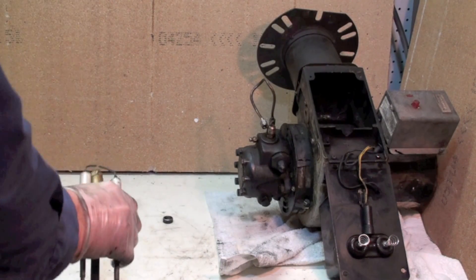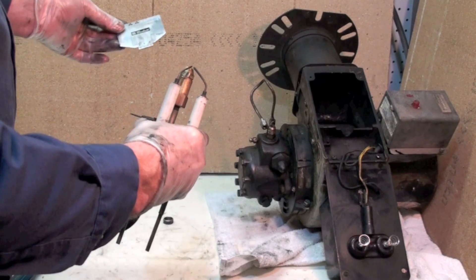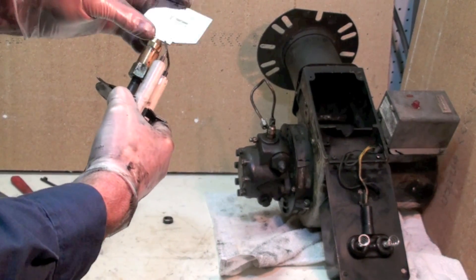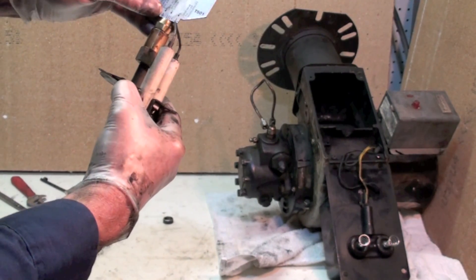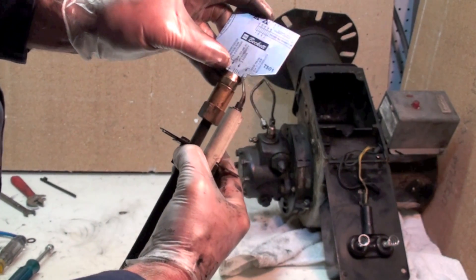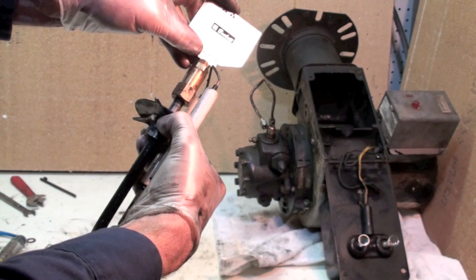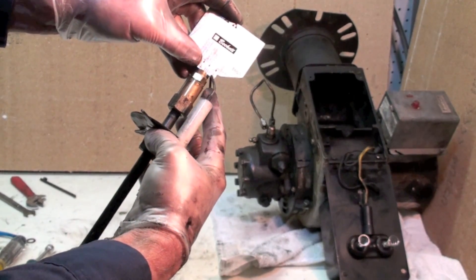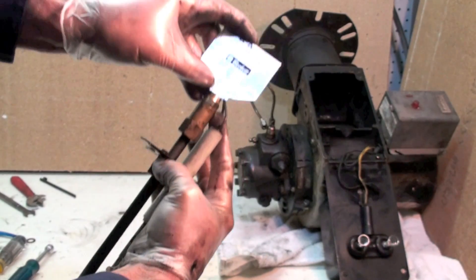Now I want to go over how we set this gun up. I've got it set up now, and the way we're dealing with this is we're using this little Beckett tool. This is a Beckett burner, so we can use this tool with it. There's a center line of the nozzle noted right there — that little arrow — and it should line up right here with this X. This is an AF2 burner, so it lines up just about right.